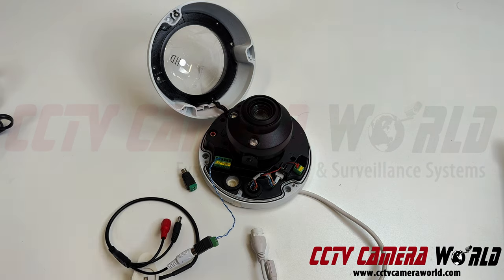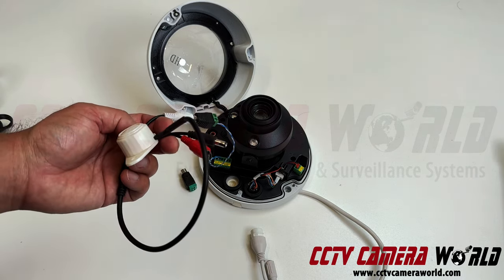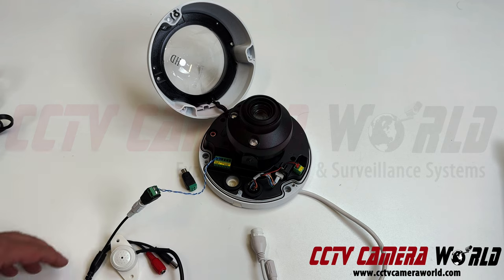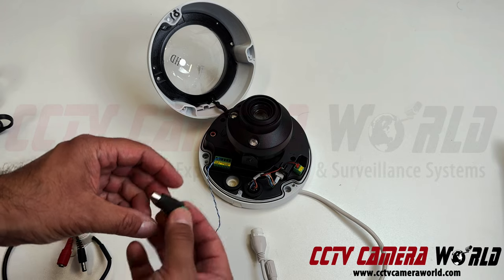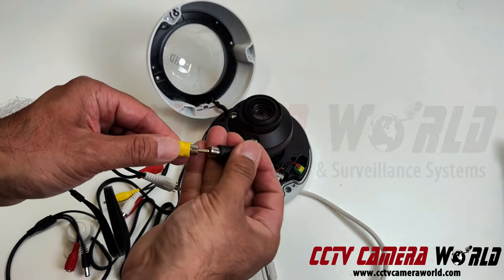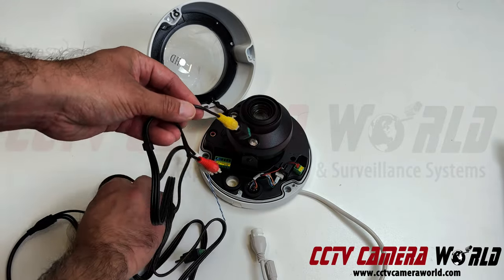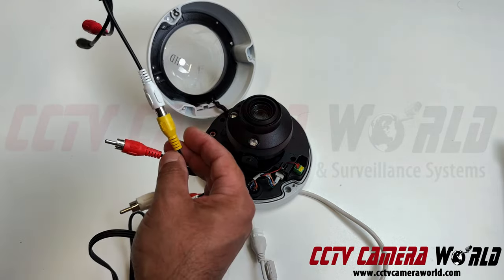So now I've got a wire going directly from the camera to my mic, and all I need to do is supply 12-volt DC power to the microphone. PoE does not power the mic — it only powers the camera. Now if you wanted to do this a little differently and position your mic further away, you could put a female connection on the camera side and then use an RCA cable to connect to the female. Use a male-to-male RCA and it goes to the microphone placed farther away.